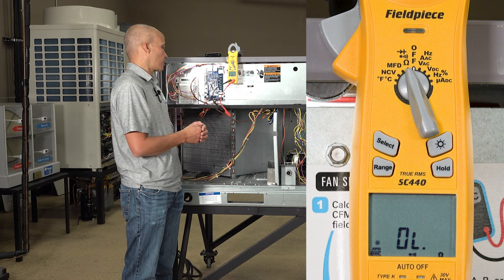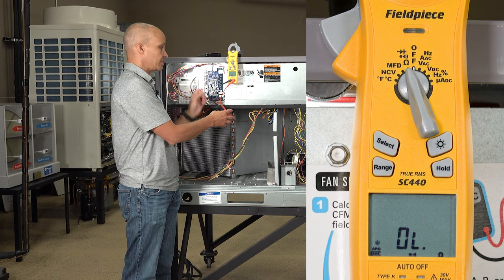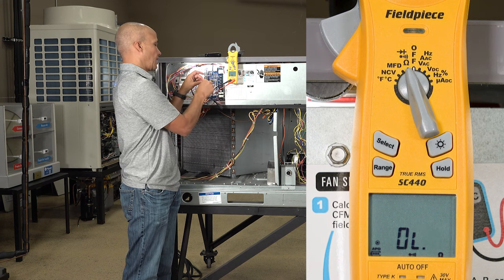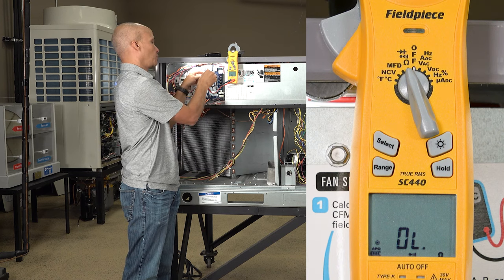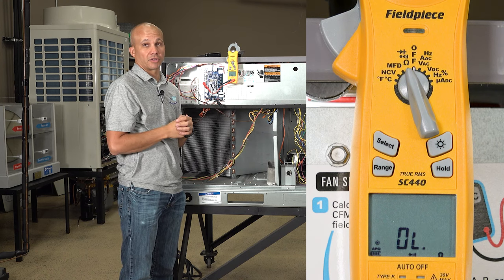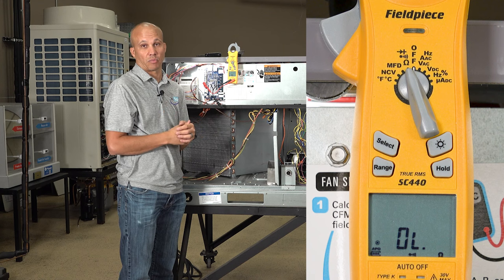Now that we're connected downstairs with the thermostat between red and white, let's see what happens. I'm still set on continuity. I always like to test to make sure it's good. Go back on here to red again and let's see if red and white can make a complete loop. It's beeping. So I have a complete loop — that tells me that red and white are both good. When I did red and yellow it wasn't good, so hence yellow is the bad wire.